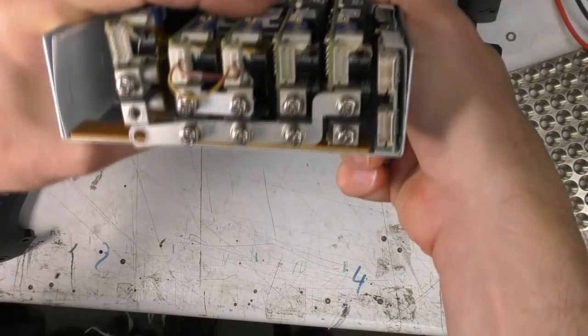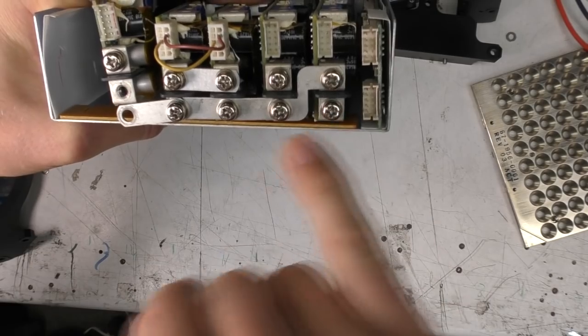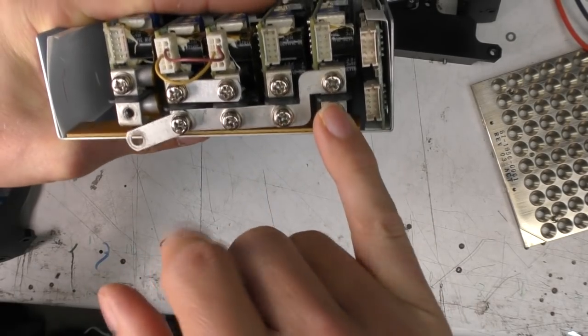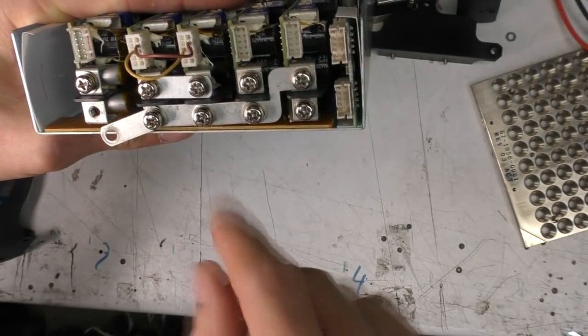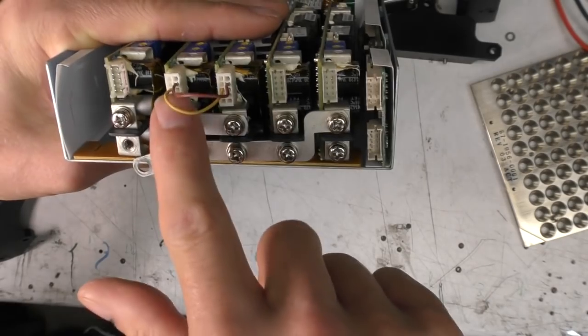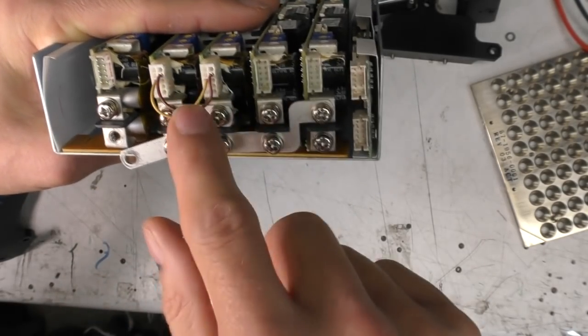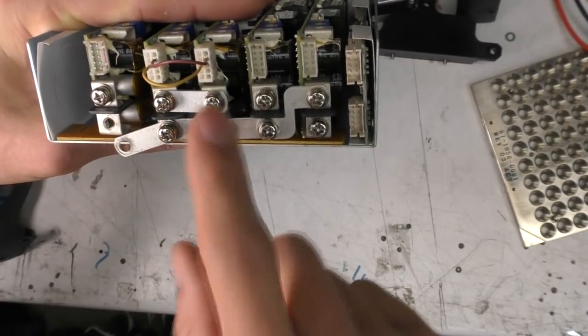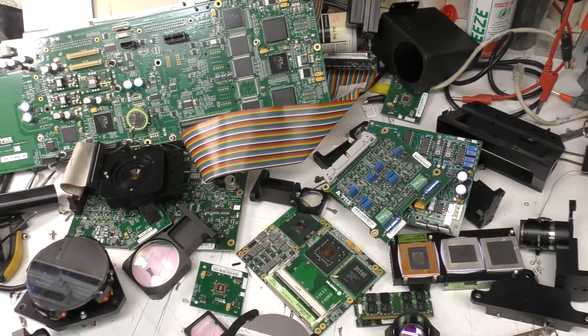And there's a bus bar on the output, so obviously these are all the positive outputs and this is a negative output. They probably need a negative output for the voice coil drivers for the Aoptix stuff. And there are control connections as well. I'm guessing these 2 outputs are parallel, so these wires will probably be for controlling the voltage tracking so it knows it's connected to another output. So that's another crazy complicated bit of gear.